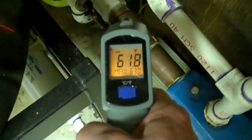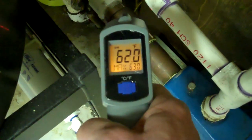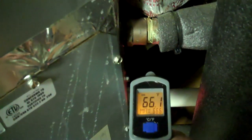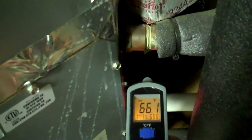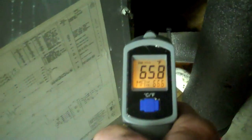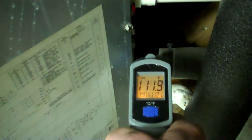So this is the water temp coming out of the ground going through the unit. We had 63-degree water going in and 66-degree water going out — that's where it's removing the heat, or coolness, from the water. And this is for the water heater: 113 degrees there and 109 there, so about 110 — changing about 3 degrees as it goes, which is nice.